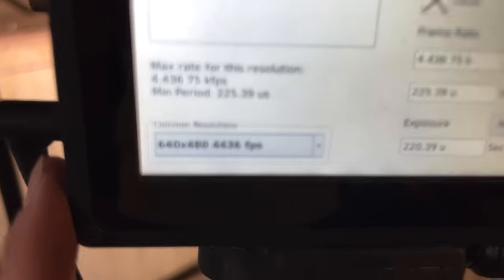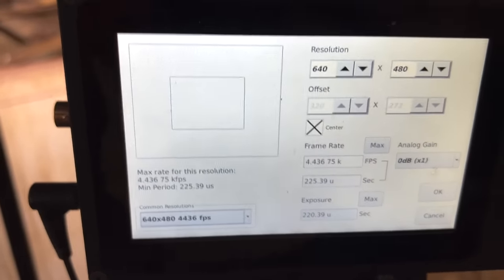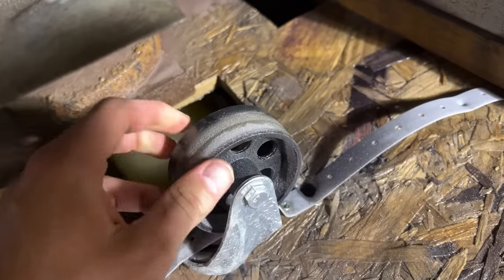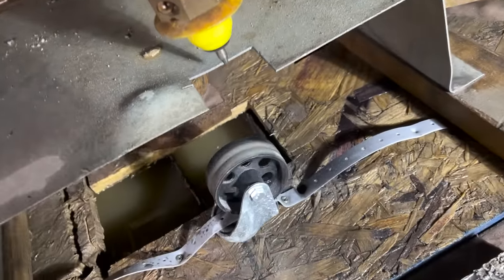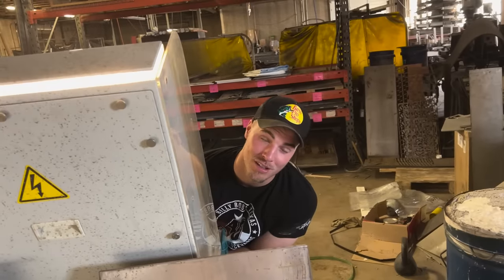You could tell how fast it's rotating on that. So we're going to try tripling the frame rate — we're going to get 480p, but we're also going to get 4,500 frames per second. A lot more of the paint was removed. After some quick math, it took 23 frames at 4,500 frames per second to make one rotation, so that's about 11,700 rotations per minute. Palmer's the math major — if it's wrong, you can yell at him.